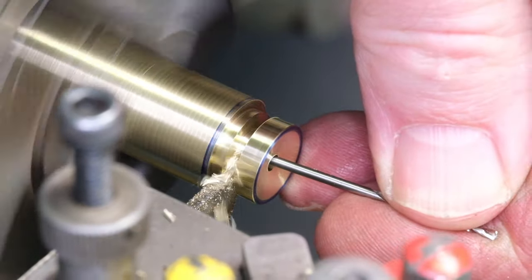So I get on to bluing the hands. Now, normally, I would not blue hands, but these were particularly variegated from a previous bluing attempt, I guess. So I tidy them up a bit before riveting the hour hand onto a new collet that I turned.